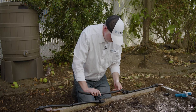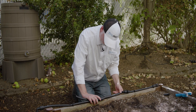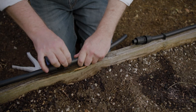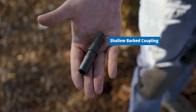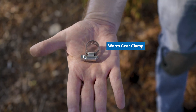If you need to fix a piece of damage that is too big to fix with just one coupling, or maybe a really small hole that may not need a coupling, check out the video in the top right or in the description below. Let's start with the barbed coupling with shallow barbs. This is the cheapest method if you already have clamps lying around. We're going to use a worm gear clamp for this first example.